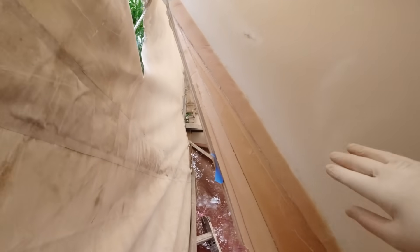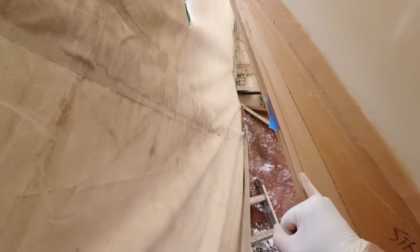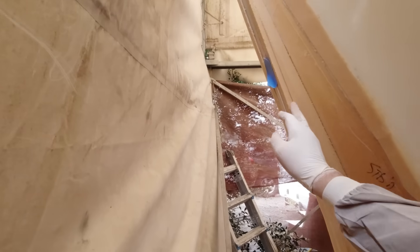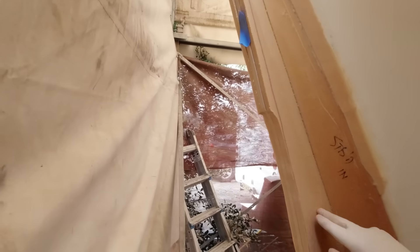So the original stem has had a slight curve, and I'm going to try to replicate that — that is what this line is here. I've actually overlaid glass right past where I want the finish of the stem to be. But this actually had a nice, sort of reverse rake, I guess you'd call it. This line here is where I'm going to take this back and then I can start to shape it and fair it in to the actual boat itself.